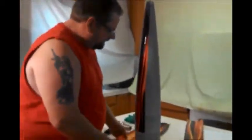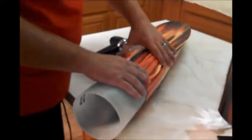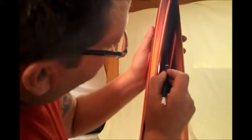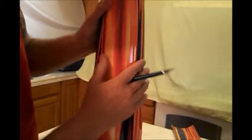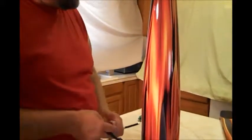We've got two pieces on now. We've got all the wrinkles out, the edges folded over at the top. We're ready to put the last one on, and it goes exactly like the second one. All you have to do is line it up, make sure there's a little bit of overlap on each side, peel your backing off, and start from the center and work your way out. It'll go just as easy as the other two did. I've got the third piece on. I worked from the center out, got it overlapping both sides. I'm going to take my knife and run that line — you can feel where the seam is and just cut right across the edge of it. Cut it right next to the other one and that piece will peel off easily. Do the other side the same way — cut the line where it overlaps so there's about a quarter inch overlap and peel that piece off.